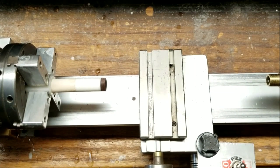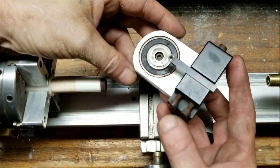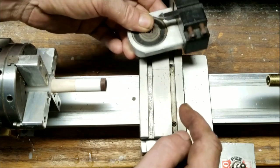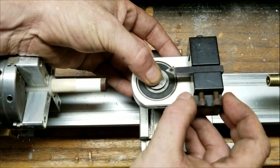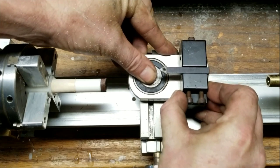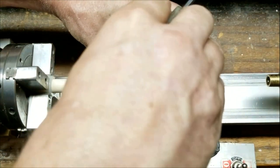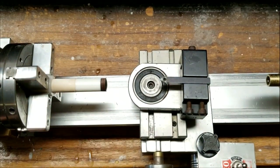And what I use is a radius cutter. Now this radius cutter is designed to do just that. It goes on the machine, it has a T-slot nut in the back, slides in your T-slot, and it has a bearing here, and it allows you to cut a radius. Now depending, let me get this on here first, depending on the radius that you want to cut will determine how far the cutter is receded into this tool post. What I mean by that is